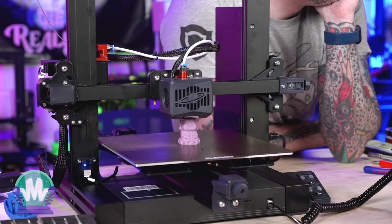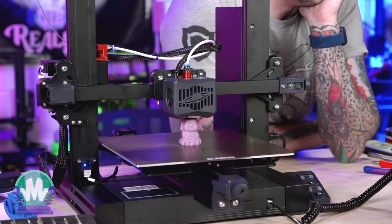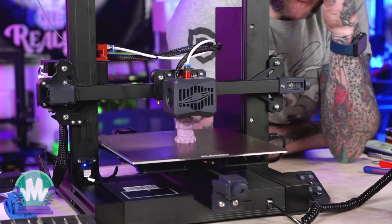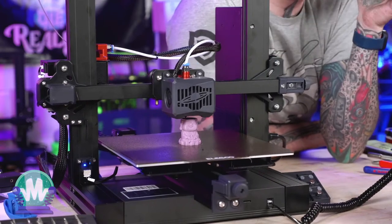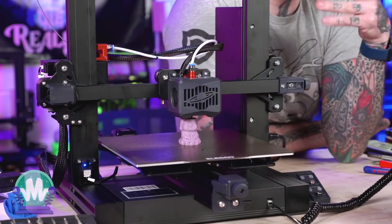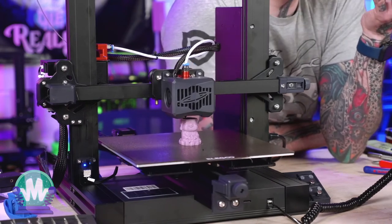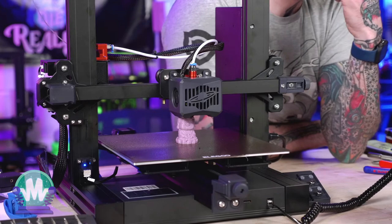What do I think about the CB1 replacing Raspberry Pi 4B for Klipper? It's really not that bad. Like, I expected worse. I expected this to have failed by now. So, the CB1, I haven't used one personally yet, but what I'm seeing is branch issues where you have to use certain repositories and certain branches, and then people update Klipper and then it doesn't work because the latest update of Klipper wasn't compatible. The problem is that the Raspberry Pi is the most supported system, and if you're not directly emulating what it does, things are gonna break eventually and or immediately.